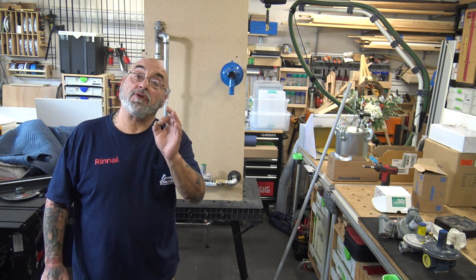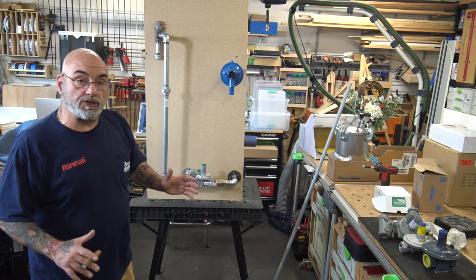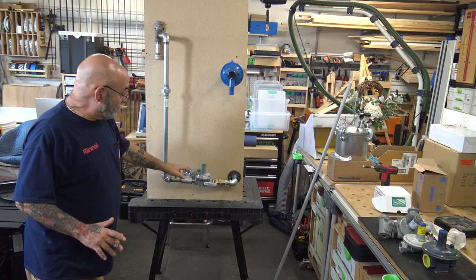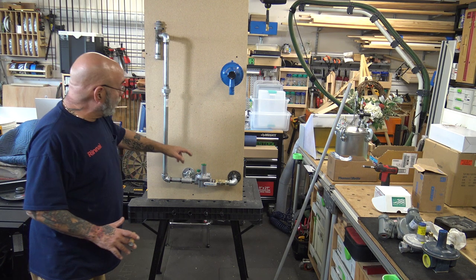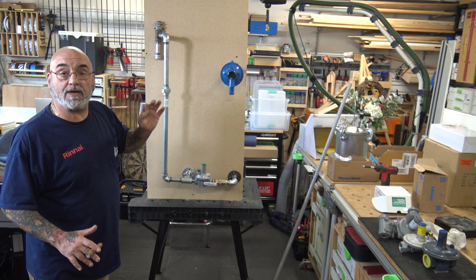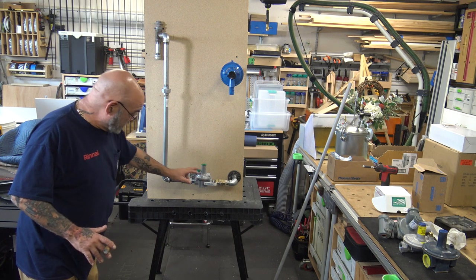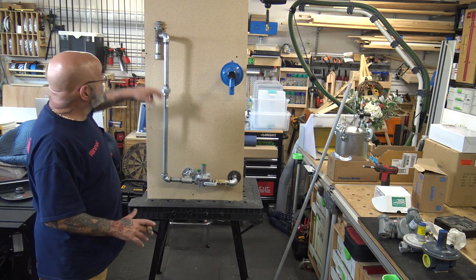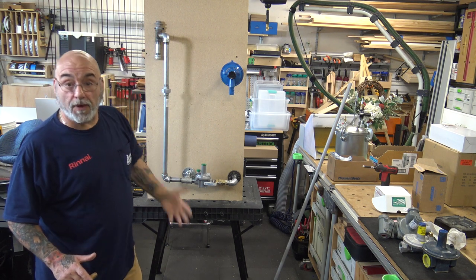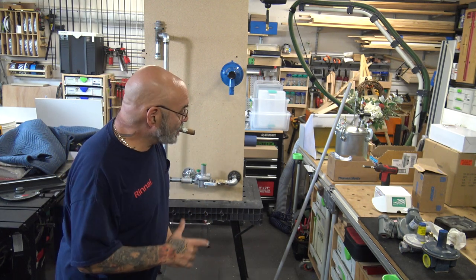And that's why for those of you that I've set up your installs, I told you to buy your T, your cap, your elbow, a couple of elbows, your valve, a full port ball valve, and a 36 inch, 3/4 inch full flow gas flex. Because from wherever, say your valve or your T, excuse me, your regulator, to the nipple and elbow, you'll be over 36 inches away because that flex is 36 inches. Okay.